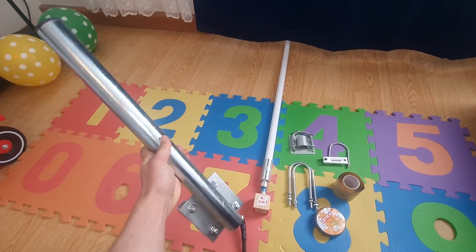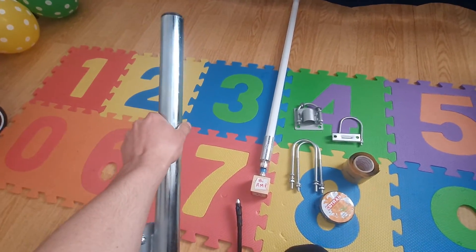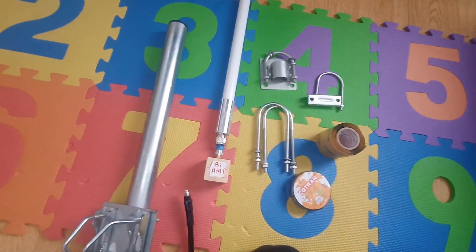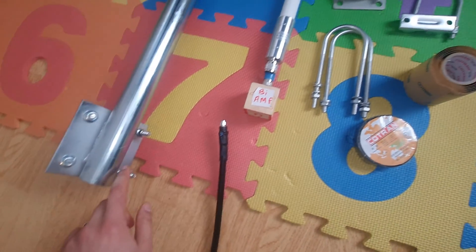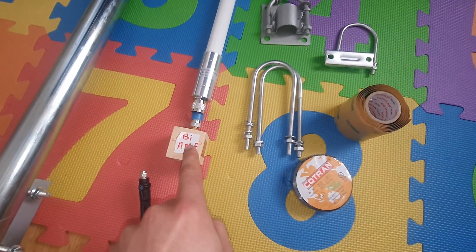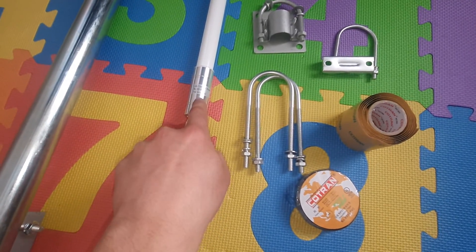I made another video about the antenna holder for balconies. It's a half-meter steel pole with good diameter — it's metal, not aluminium, because I was worried aluminium would bend in the wind. I will put some oil on the screws so they don't rust. Now from the antenna connector, remember: the bidirectional amplifier and LMR-400 must not be placed next to your miner — they must be connected directly to your antenna.